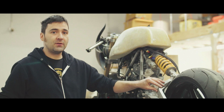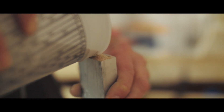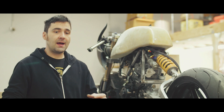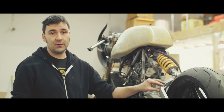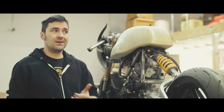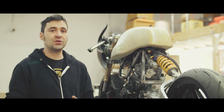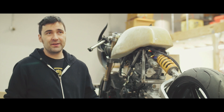The first try with a hollow tube just ended up flattening the tube out, so I knew that wouldn't work. The second try was to fill the tube with sand — I've used that before with exhaust bending and it worked pretty well — but with sand it did the same thing. As the tube bends it gets longer, the sand gets less tight, and it ends up flattening anyway. The third try was to anneal the tube, fill it with sand, and bend it. Problems with annealing are that once you soften the aluminum you have to get it heat treated again, and after heat treating it ends up bending and warping, so you're not totally sure you'll get the final angle you need. And when I annealed the tube and filled it with sand, it flattened anyway — totally defeated the point.